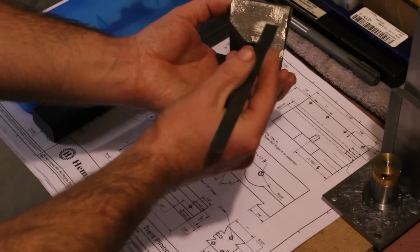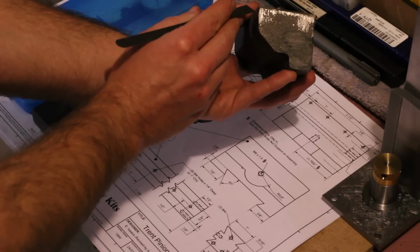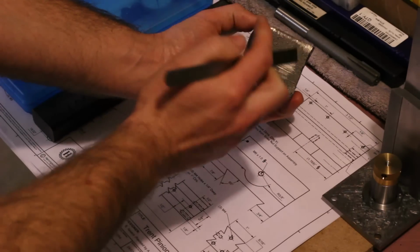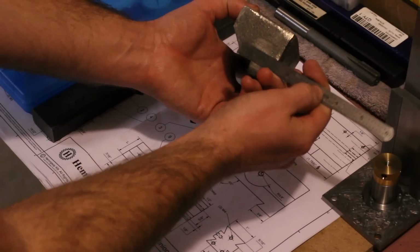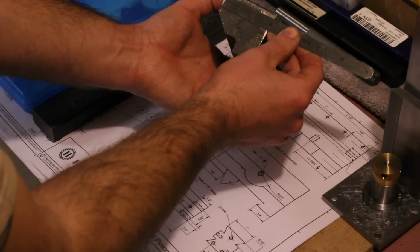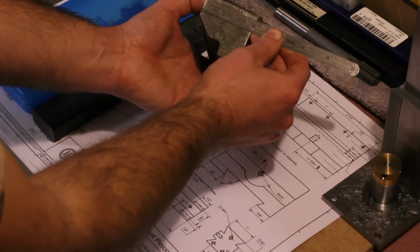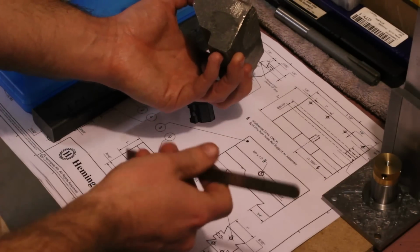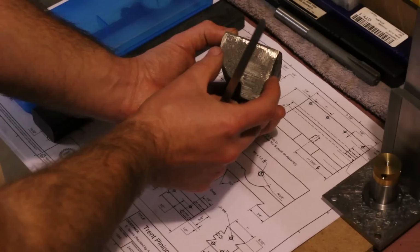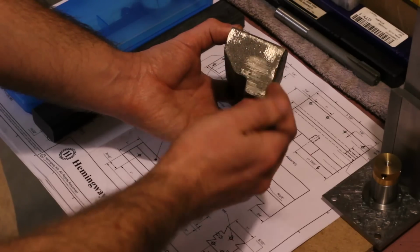To further complicate things a little bit, if you look, there's a low section around the front here where the saw marks are. If we were to try to line up against that, we kind of have to do it by eye again. That's already 2 inches right on the money there. Again, the dimensions aren't critical. This is our primary focus for machining this part, to make sure that we make the most use we can out of the meat that's in between here.